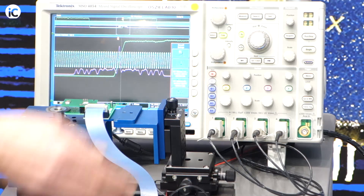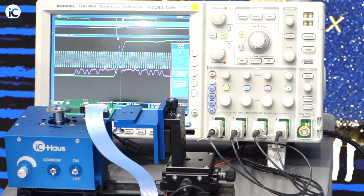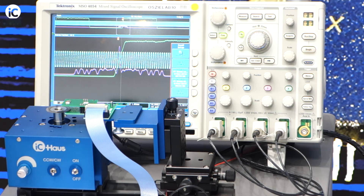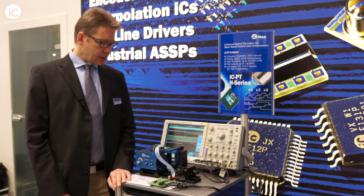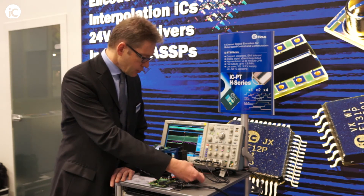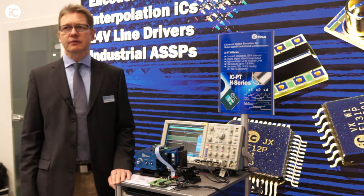Now I have a look into the encoder at the amplified sine-cosine signal, so we can see the gate as the index, sine-cosine, and the analog U signal. That's a clear advantage for setting up operation, so that you align the encoder — you can do this with the help of analog signals, even better than with the digital signals.